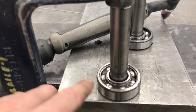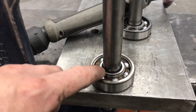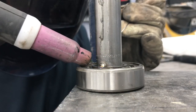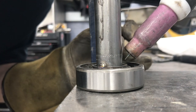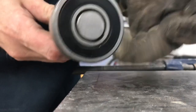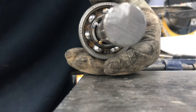The first thing I'm going to do is just put a couple of tacks on the bar and the bearing, so I'm not applying too much heat and the bearing still runs freely. There you can see it still runs smoothly and freely — ideal. Just a couple of little tacks on the back, I think that's all we need.